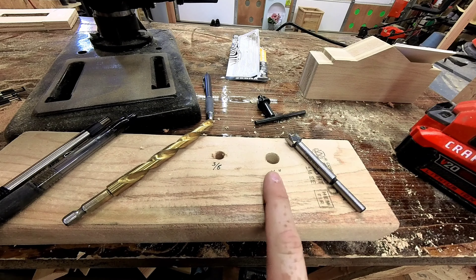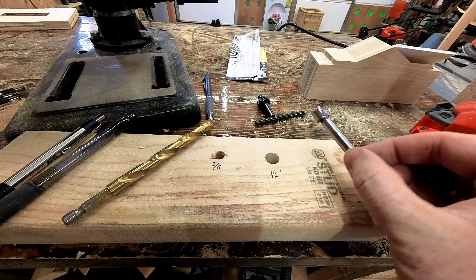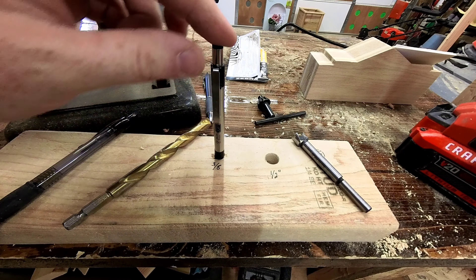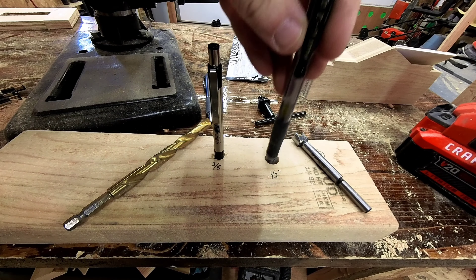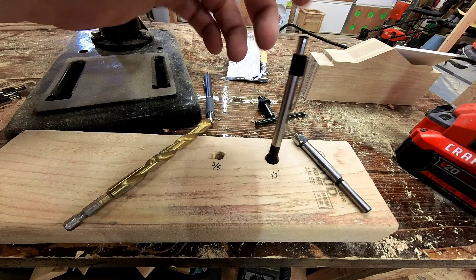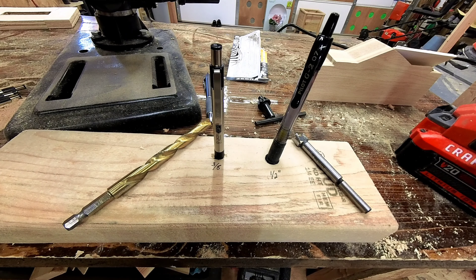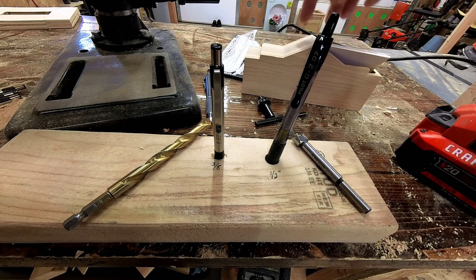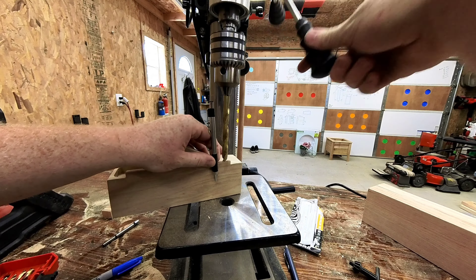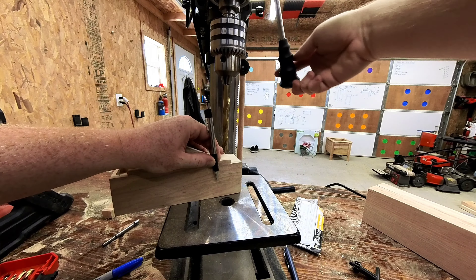There's not much between a half inch and a three-eighths — only about an eighth of an inch. I have a half-inch Forstner and a three-eighths standard drill bit. The three-eighths fits these guys very nicely; the half-inch fits them loose, and I don't want them loose and cockeyed. So let's do three-eighths and we'll put the Zebra pins into the other one. I set the depth using a pin as a reference point — these had to be perfect. The Zebra pins are aesthetically pleasing and will complement the workpiece perfectly.